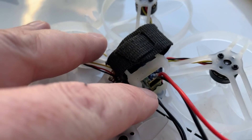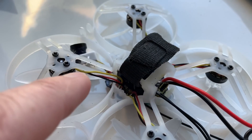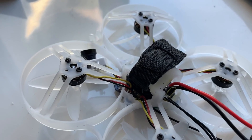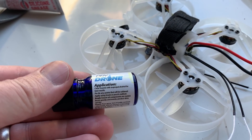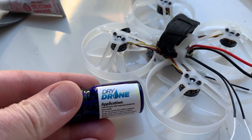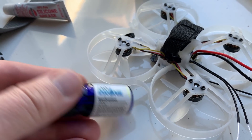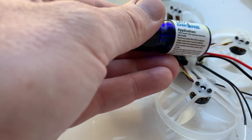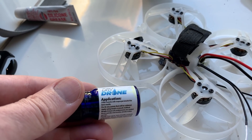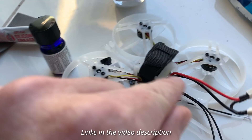You can see it's all wired up here and the motors are direct soldered on. I've got silicone conformal coating on those wire connections, and the flight controller down here is also very shiny because of the amount of silicone conformal coating on there — there's really no way water should get in anywhere. The only place where water might cause a problem is the USB, which has 5-volt power and serial connections to the flight controller, so we don't want water getting in there. For that I am using DryDrone. It dries super fast and creates a water-phobic coating at a microscopic level. I've never tried it with a fully submerged drone, but I hope it's up to the challenge.